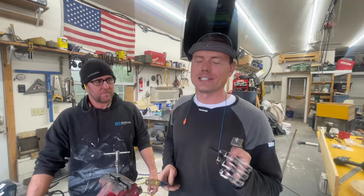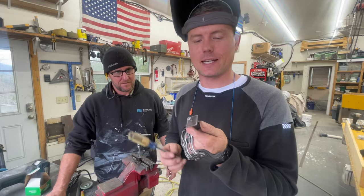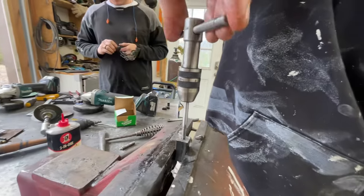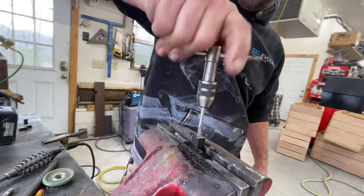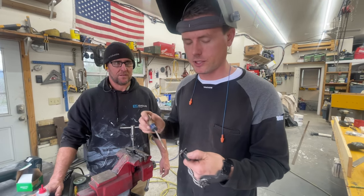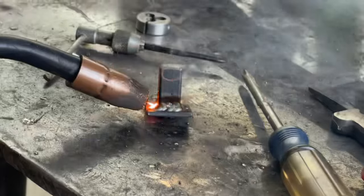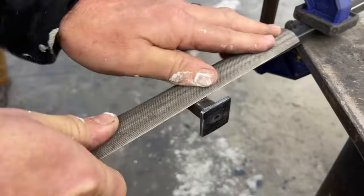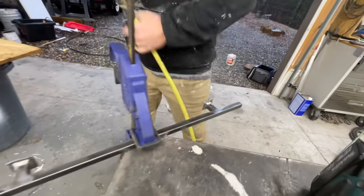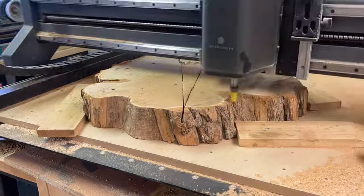I just realized we're doing something really ridiculous — we're making hardware for these drawers. We're doing things like drilling and tapping these tiny little blocks so we can attach the hardware from the back with hidden fasteners. Jason is here with a 10-24 tap, drilling through the hole and putting threads in for me. I'm actually screwing the pieces on that are going to get welded on so that when I weld them, the holes line up perfectly and they're centered. These are really small parts and it's difficult to align and hold them in place while you weld.